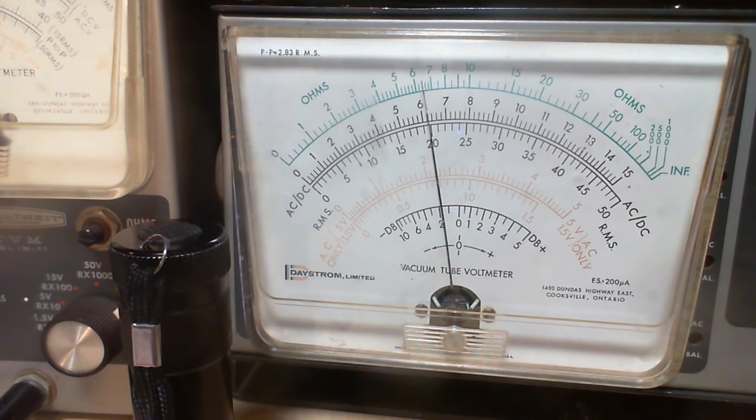I think it is slowly drifting down. So the effect of the drifting AVC on the radio, because it's drifting downwards, means the radio will get louder. My interpretation, unless the change isn't really a problem with the AVC, it's actually something else in the radio that's changing the signal strength going into the detector. I mean, that's very, very likely too. But it's not going all the way down to 3 like it was. Okay. Lots of interesting observations. May not be adding up to much, really.